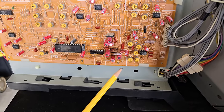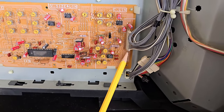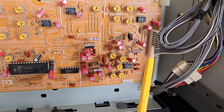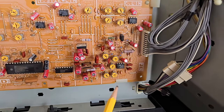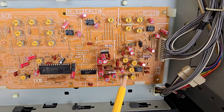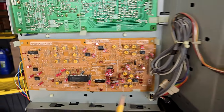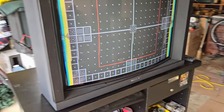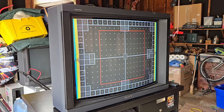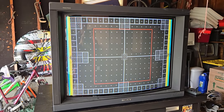What that resistor does is: the 16 volts comes in from the power supply through this cable connection point right here, and that's the first resistor the 16 volts hits. It was just fried. The 16 volts comes in there, hits the voltage regulator, and sends 5 volts out to the rest of the board. That was our issue. And wow — look at that thing. We've got a 32-inch CRT PVM that is now working!